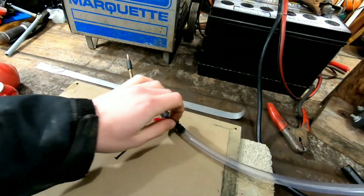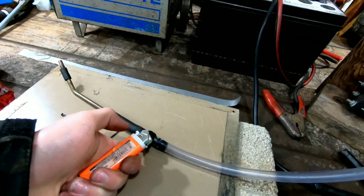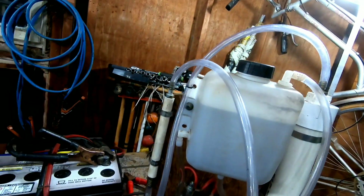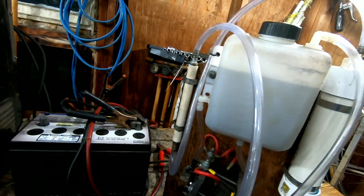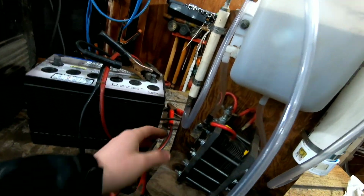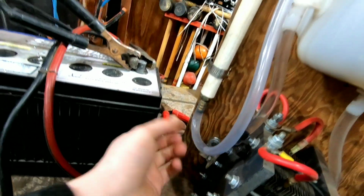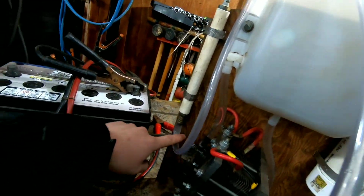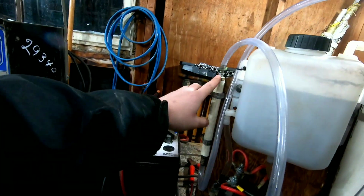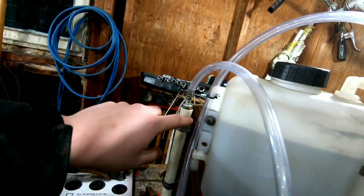I could sit here, unplug this hose off the torch handle, and sit here with a lighter and light this thing all day long. It would just keep snapping back into this pipe, and never go any farther than that, unless the water level gets really low, which it really should never get unless it flashbacks a lot and water does pump out the top of it. But as long as there's a water level in this tube right down here, you're fine. And the most that will happen is it'll blow up that much hydrogen, and that's enough to make a little pop, and that's about it.